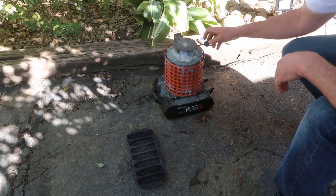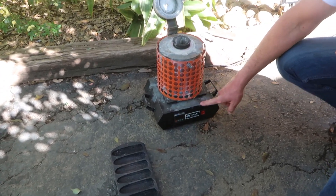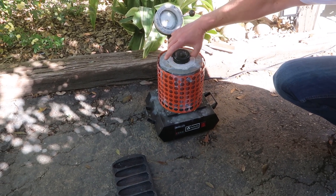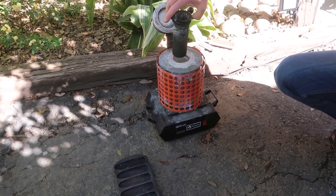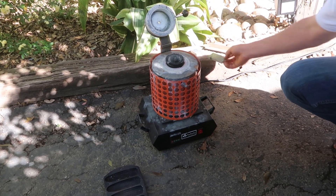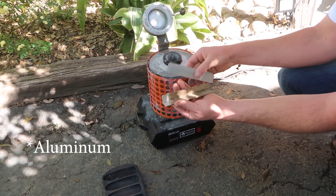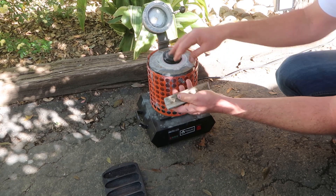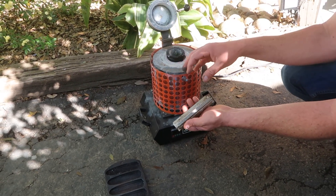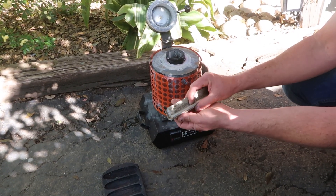So I want to get some aluminum melting. This is an eBay 110 plug-in electric furnace, and it has these lift-out crucibles that we're going to fill with molten metal and lift out. Today, I don't want to put in brass — I'm going to put in aluminum. And I have this dirty angle iron, really dirty, which is going to be good because it's going to make all sorts of crud and slag on top of the puddle. When we pour it through the filter, if it does go through, hopefully we can skim out some of this junk in the molten metal.